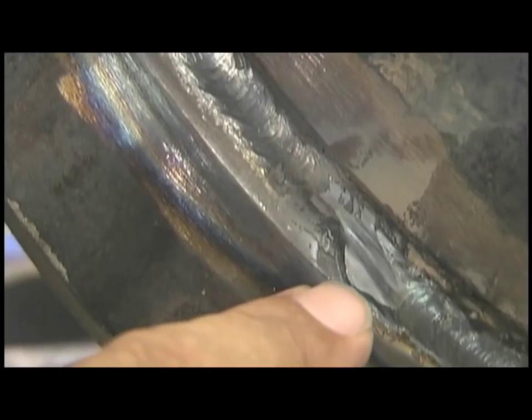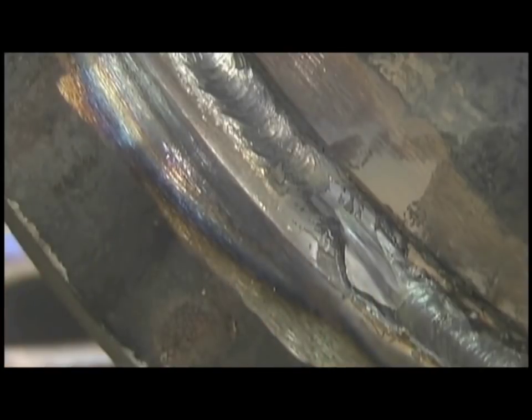Again, I light up ahead of where I want to start, then weld over all those arc strikes, and I'm just kind of lining up halfway over that first pass. I'm trying to leave the bevel. I'm trying not to come all the way out to the bevel, so I have a nice sharp line to put a nice cover pass on.